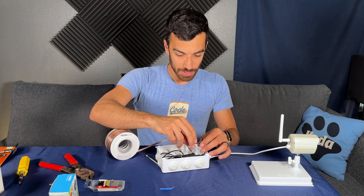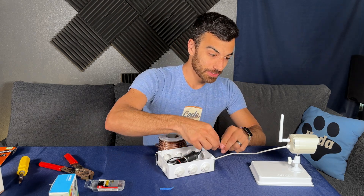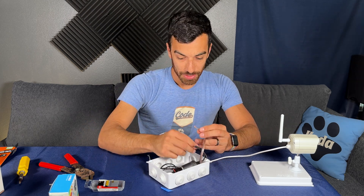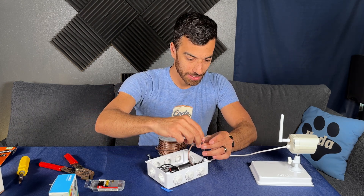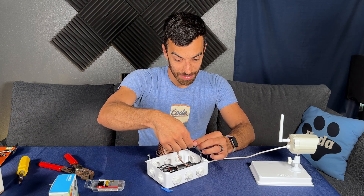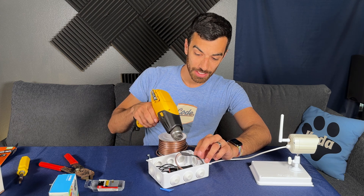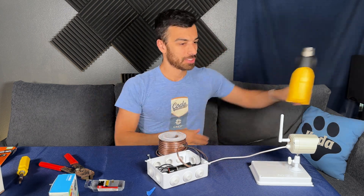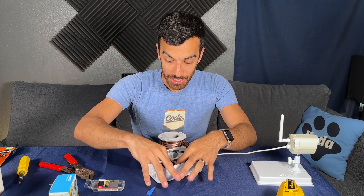Put the shrink tubing on each wire. Now we're going to run them into the same hole that we punched for the camera so that there's only one hole to re-waterproof. Connect the positive to the positive. Note there's no soldering required. If you don't have shrink tubing, you could use wire nuts instead — this is just what I had around the house. Now we have our heat gun and I'm just going to go ahead and heat these. And there we go — make sure it doesn't start a fire. So we have everything connected in here, which was extremely easy, nothing too crazy.